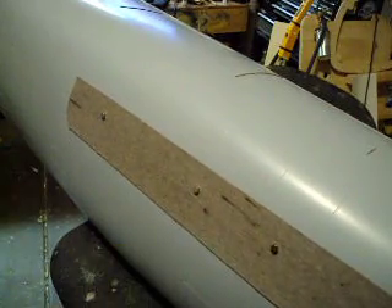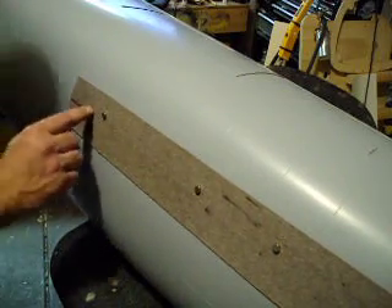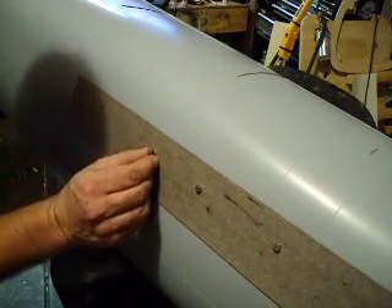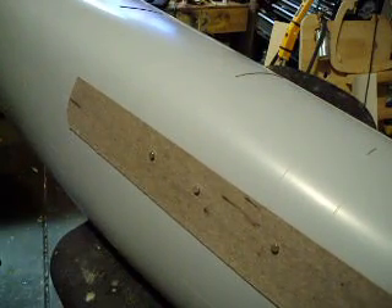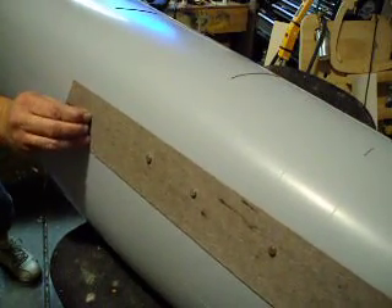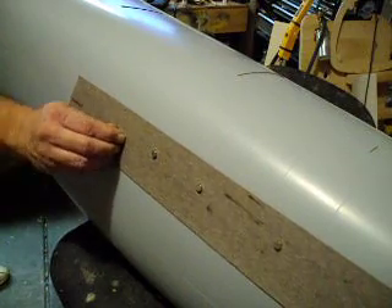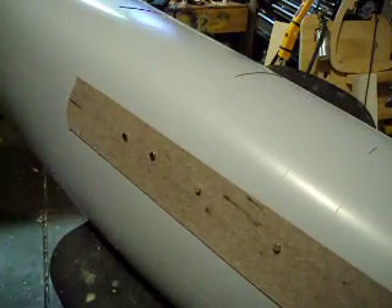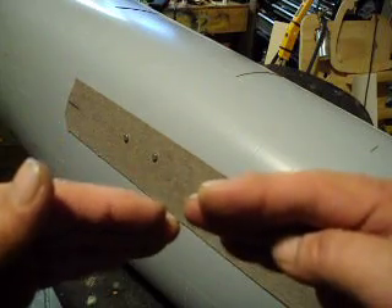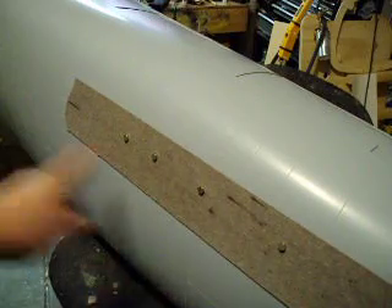And I just want to gently just pull that bottom in to make sure that's all flush. So I'm putting these magnets down there, and I can put them on right here and just slide it down to where I need it. That way I'm pretty sure that's going to pull that bottom in flush and we'll have a real nice seam there yet.